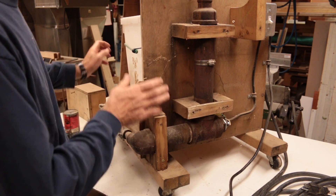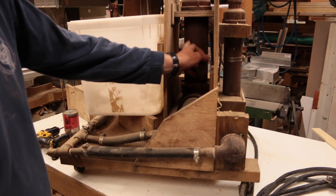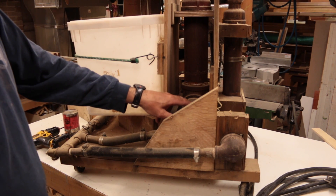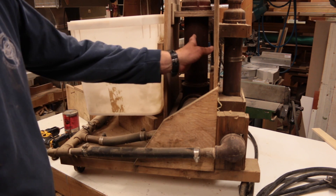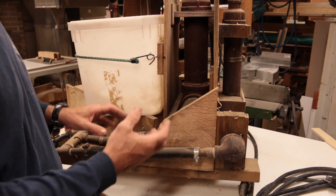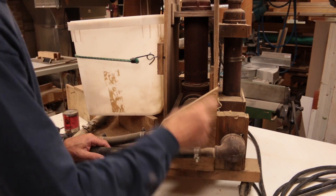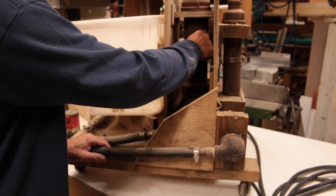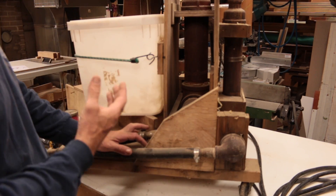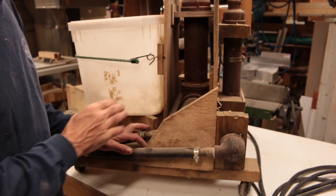This is basically a two-banger unit. This one here is a larger version — I've gone up to 3-inch pipe with a 240-volt hot water heater coil. The reason for the larger pipe is to generate more steam, since steam production is a function of surface area. But if you make it too big, it takes too long to get up to steam. I've found this is a good compromise — this thing is up and rolling in about five minutes.